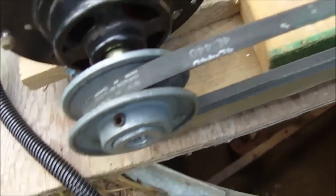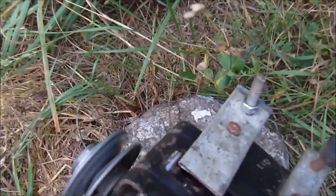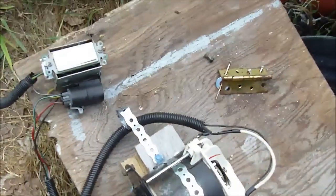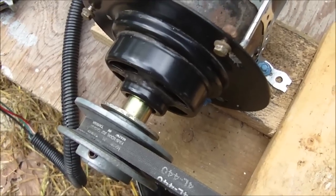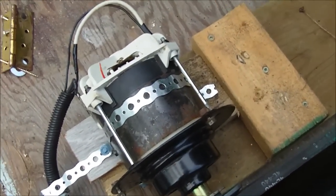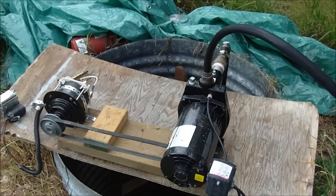The pulley here is just off of a normal induction motor — you can see this motor has one as well. Basically you use an Allen key and stick it right onto the end of this shaft here. You might have to file it a little bit to get the pulley on, but other than that it's pretty simple. None of this is permanent — it's all temporary, just a test phase. I'm making this video because I think there's some useful information for people with an off-grid cottage or a hunt camp somewhere remote who have a well but just don't have the power to pump the water.